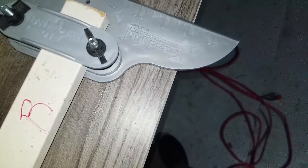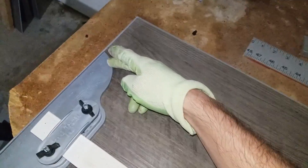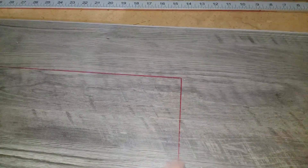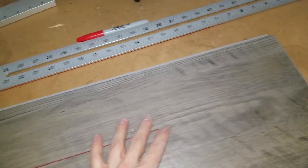I'm going to line it up on the 10-inch mark since that's where the tread ends. It looks like this is actually angled again, so I'm going to slide it back until this end is flush with the very edge. Now that this is lined up, I'm going to draw a line right here and mark the corner. I'll take a straight edge and connect the end right here to make the length of it — that's my mark, this is the outline of the tread. I'm going to use the jigsaw because this has to be a very precise angle, and it's obvious if you deviate with the circular saw since the blade is not where you're looking. I'll do the circular saw on the hidden edge since it'll be out of the way and it doesn't matter too much how accurate it is — the circular saw is much faster for that.